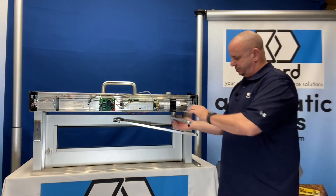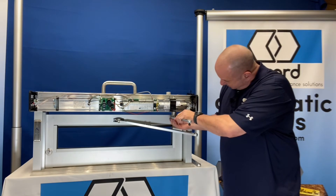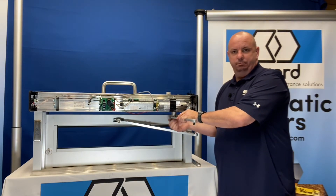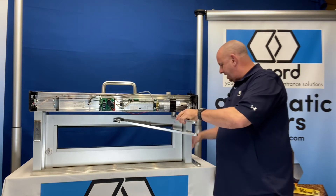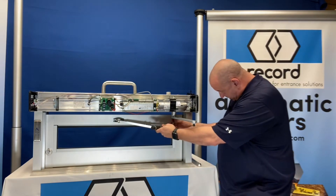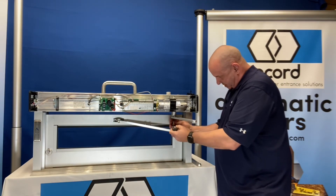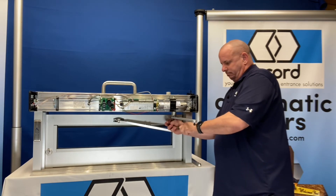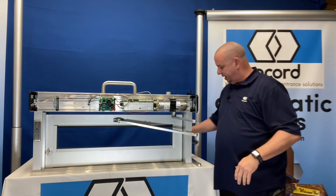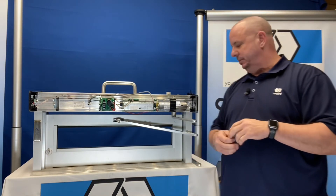You'll want your final position to be negative 90. So I'm going to take this, drop it down, move it over one notch, push it back up and tighten it. With that tightened, I can take a 6mm allen wrench and a ratchet and tighten my spindle down. You want to tighten this pretty good because it is a graduated output shaft, and when you marry the two up you want them nice and tight.